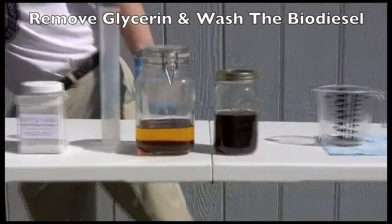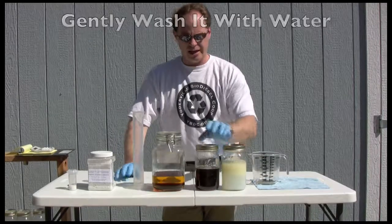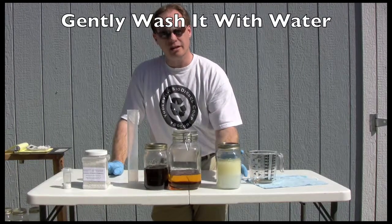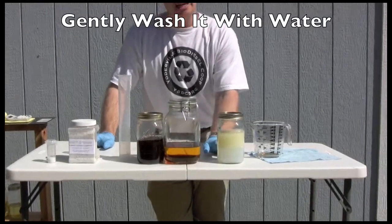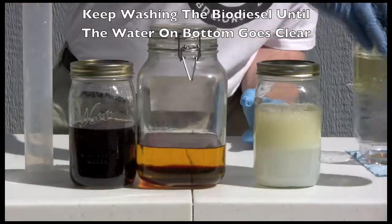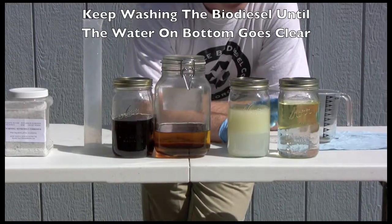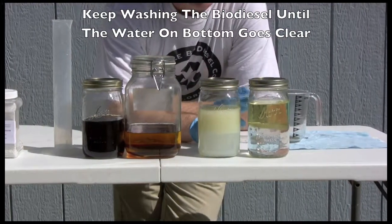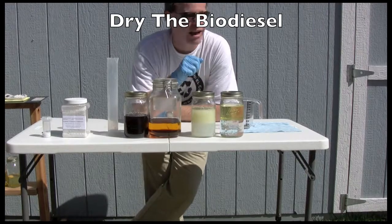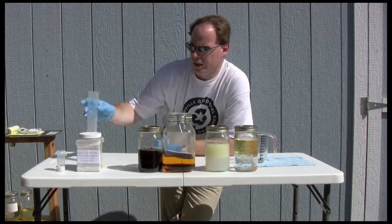What you do is let it sit for about eight to ten hours and the glycerin will settle out off the bottom. You'll get a beautiful separation layer between these two — the stuff on top is biodiesel and the stuff on the bottom is your glycerin. After you've removed your glycerin, it'll be important to wash the biodiesel. To do that, you're going to use some water and mist that water into the biodiesel. What you'll notice is on the bottom it will go cloudy — we're actually removing the excess methanol, catalyst, and lye that's still stuck in the biodiesel. Continue to wash until the water on the bottom goes clear. The water on the bottom of this one is nice and clear and my biodiesel on top is still somewhat clear. Normally your biodiesel may not go as clear on top, and that's okay — that just means you need to dry the biodiesel so the water will come out of it. You can do that through bubbling or just leave the lid off and let it air dry. Most commonly, bubbling will help.